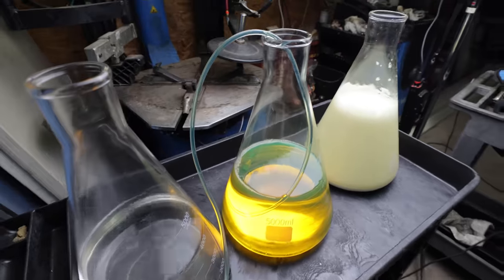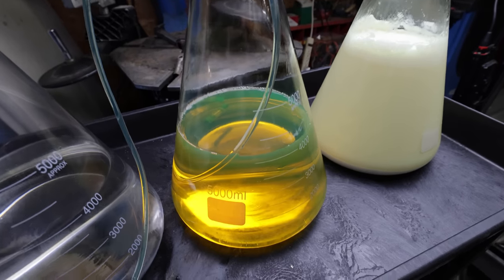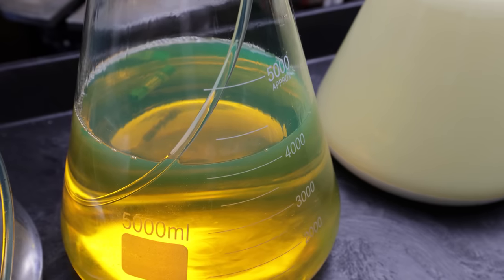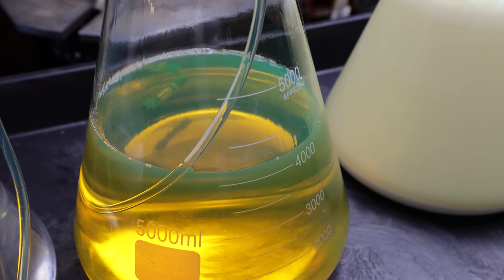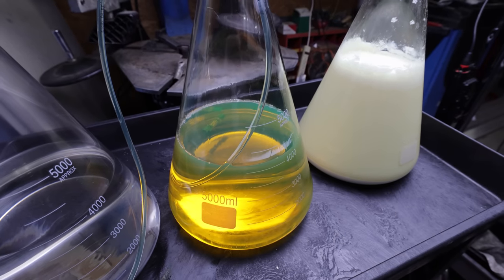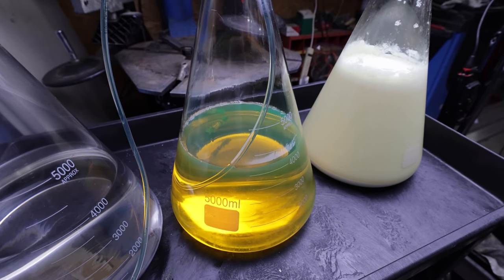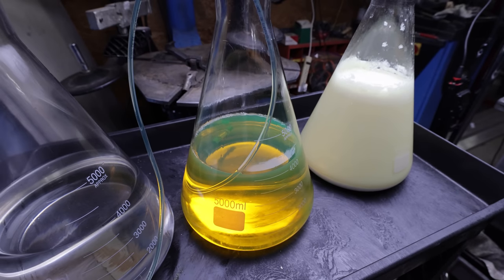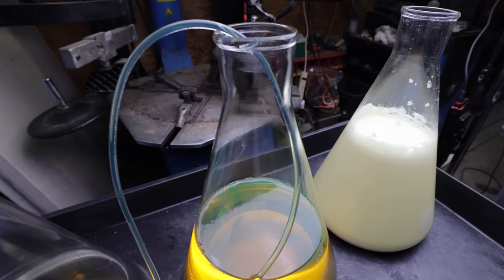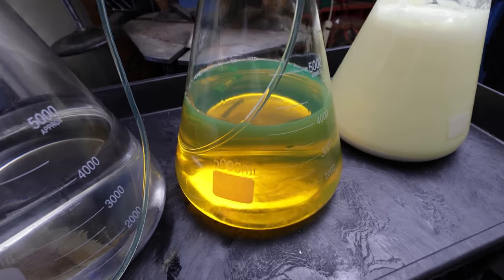That was biodiesel. It sounded slightly different, and it seems to have burned less fuel than a diesel. Just a little bit less. I did the same run, which was warm it up, do 20 seconds full throttle, 20 seconds at idle, 20 seconds at full throttle, cool down, and then shut it off. I did the exact same sequence with my timer, and it definitely burned less fuel.